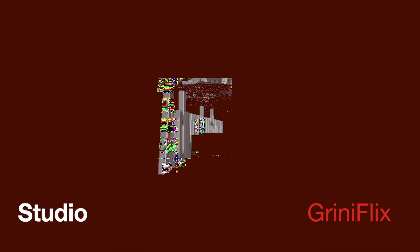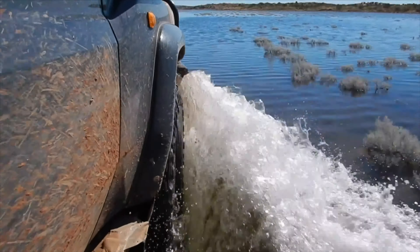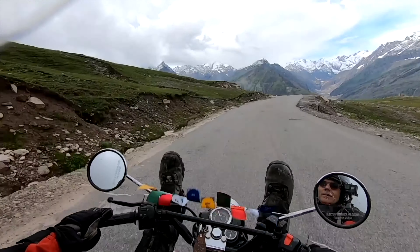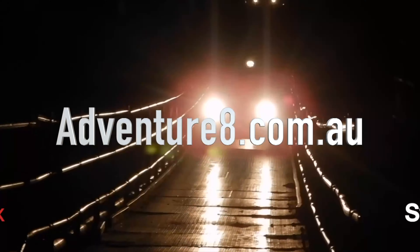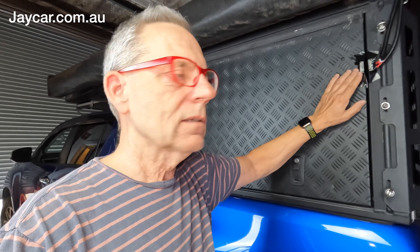The good news is, I have done it, and I can show you what I've done. A switch has to be installed somewhere for this to work. What I've come up with is something from the local electronics store in Australia, in Sydney — there's a crowd called Jaycar. They can provide different components. So what I was thinking was to get a reed switch that could be activated by a magnet, so when the magnet gets close to the switch, it turns it either on or off.